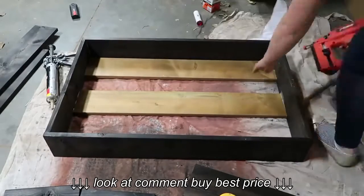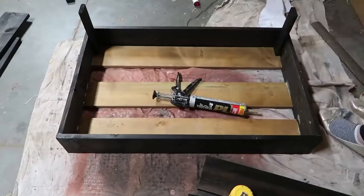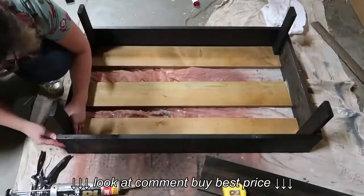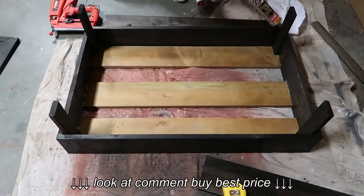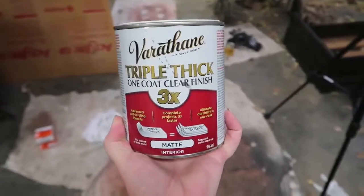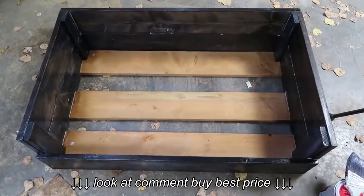The extra pieces on the bottom measure about 36 inches — I'll leave all measurements in the description box below. Next I nailed the one-by-three pieces upright in the corners of the bed to attach the next long pieces, creating the higher back and sides. I put a bead of PL construction glue and used the finishing nail gun for the back and sides. Then I applied Varathane Triple Thick Sealant over all the stained wood parts, and there is the completed dog bed.